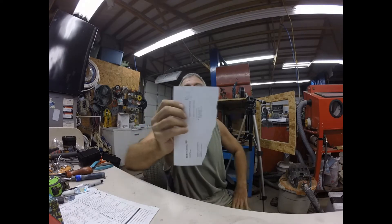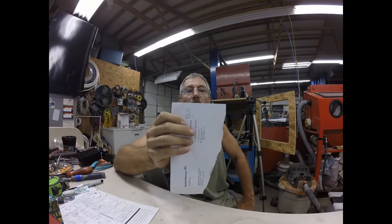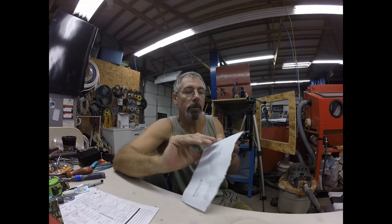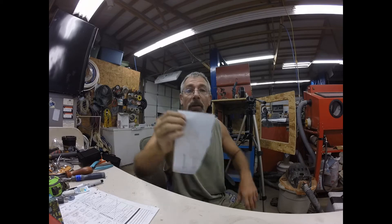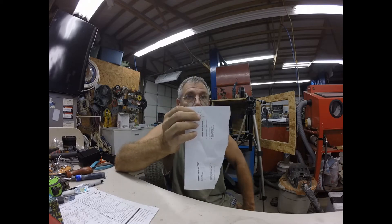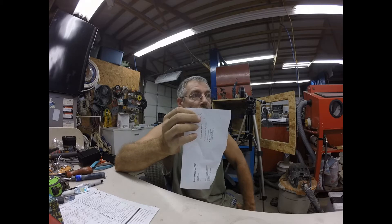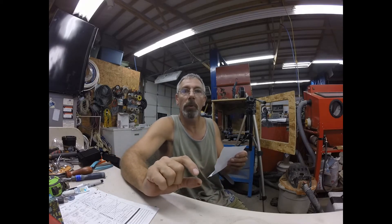If you need to adjust, in my example I had come up with a z offset of 2.0. I ended up — as you saw on the LCD — with a final offset of 2.1. The reason for that was I was printing a little bit too tall, so by increasing the z offset number it brings your nozzle down closer to the bed.